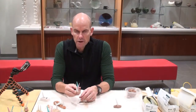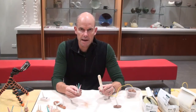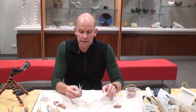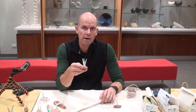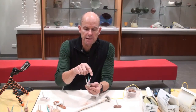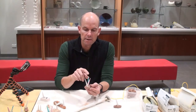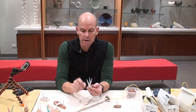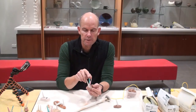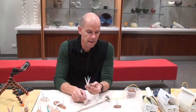So if you've got cones in your kiln and you're using a thermocouple as well, you've got a really good idea of what's happening with the firing. Your thermocouple is a guide to whether you're going up or down. The cones are a guide to when you've reached temperature. Here we've got a cone 9 — that's our guide cone, telling us we're getting there. Cone 10 is our target cone. Cone 11 is our guard cone. The guide and target should bend over, and the guard should still be standing. Then we know we've hit the right temperature — a cone 10 firing in this example.